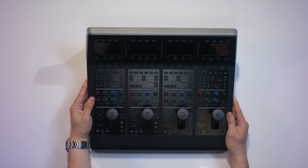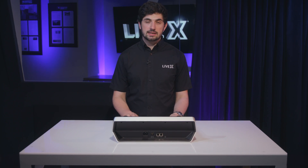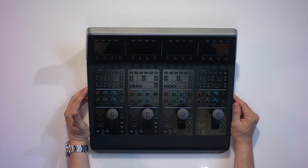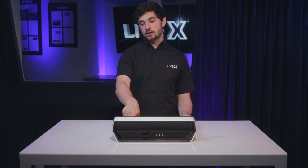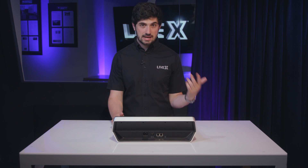As you can see, there are four separate panels and those can each be assigned to different cameras. What's great about it is you're not locked into which camera you're using on each panel. Up on the top is where you can select which camera you use. If you're on a 4ME, for example, you have 20 inputs and you could just select whichever input you'd like — that's the camera you'll have control over as long as you have an SDI send and an SDI receive.